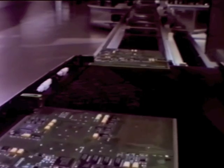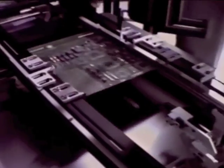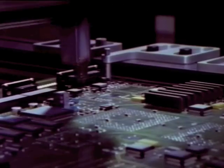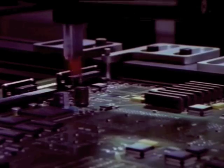It's emerged with the highest density of components combined with the highest production quality controls in the computer industry. The board arrives at the through-hole insertion robot, which places, as its name implies, any through-hole components onto the board. It has two specialized arms — one chooses the part, the other inserts it into the board. Together, they can handle about 70 parts of all different shapes and sizes, and perform a number of complex operations.